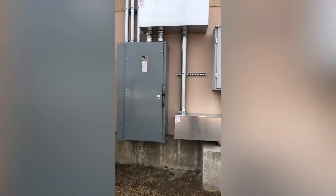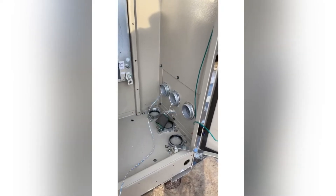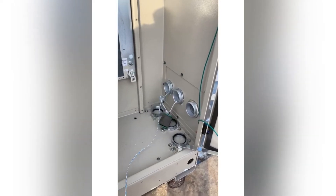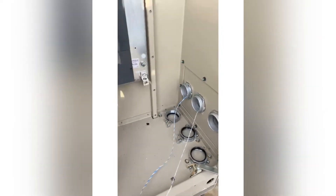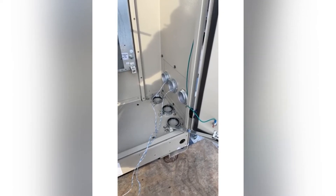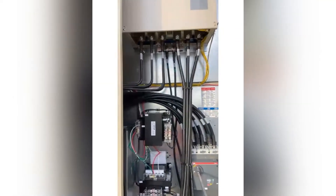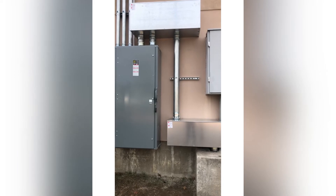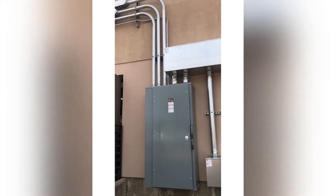While we wait to pull the wire, we're gonna pull in some string - we call that a rat. We push it from the next end with the vacuum, pull string in all three of these, so when the rope comes we can just pull it in, make our nice head on the wire, put a rope on it - we have to use a string to pull it. We just can't stop showing this thing, it's one of a kind, everybody who passes loves it.